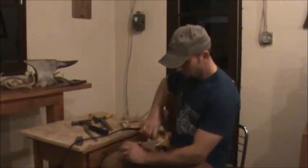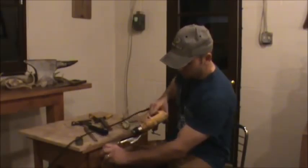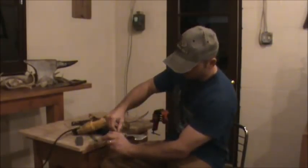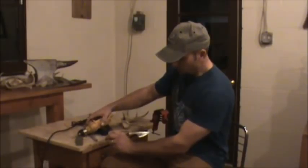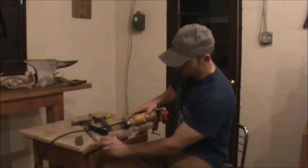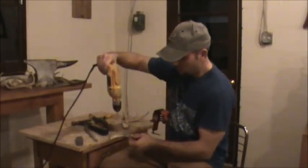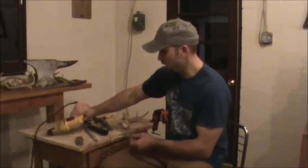And I just took the drill in here. Make sure you get it nice and straight. Put two holes, one right there, one right there. Get them down in. And there I took the tang down to there. And what I did was I just took the two holes and wobbled that drill up and down until I got the slit. And I pushed that in there. And then drilled it down through two holes to pin it.